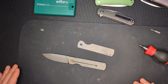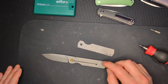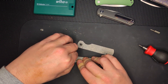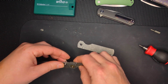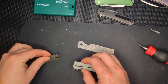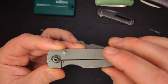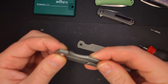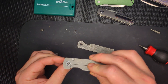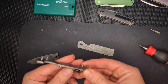And we're back. That was extraordinarily fast and easy to take apart. We've got two barrel bolts here at the back. This is a frame lock. We've got no steel insert, which is kind of a shame because the price of this knife is fairly expensive. Given that it's American-made, you'd kind of want to see a steel insert here, but we've got a ceramic ball here, and you can see that the grease is nice and dirty, which is fine. It is a free-spinning pivot, which is not the best in my estimation — not for $450.